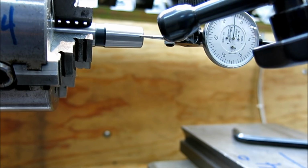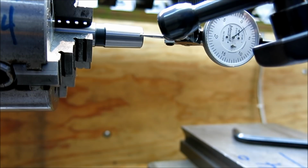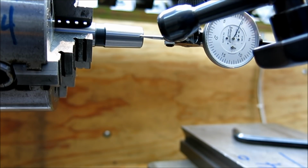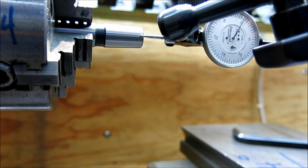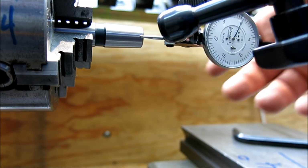Okay, so the indicator needle is at the 12 o'clock position. Can you guys see that? Let me back it off a little bit. Let's go to the 0, and then you guys can kind of see it. Now I'm going to move this microscope slide vertically here. I actually got it pretty close. So I'm going down, down, down. And see, the needle started to change direction, right? Let's do that again. Boom. It started changing direction. Down, down, down, right there. That's a null reading right there.